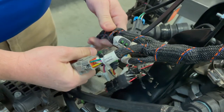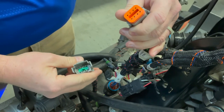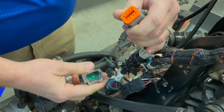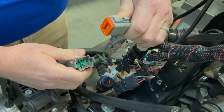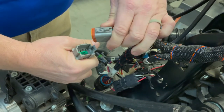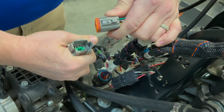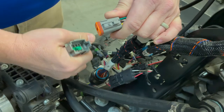Next, visually inspect your wiring. Take it apart, look at the connectors, and make sure nothing's corroded. If you've got older AMP-type connectors, really inspect those — dirt gets inside and can cause corrosion. If you've got any corroded pins, work with your local Landmark dealer to get those replaced.